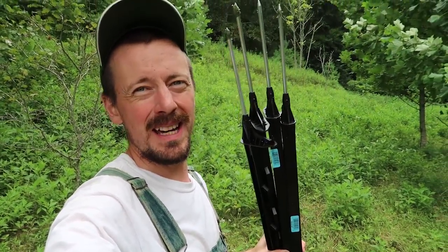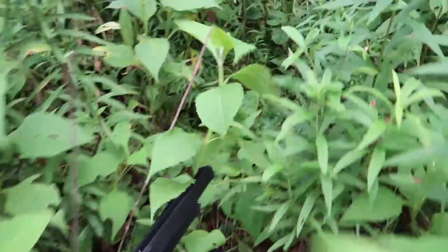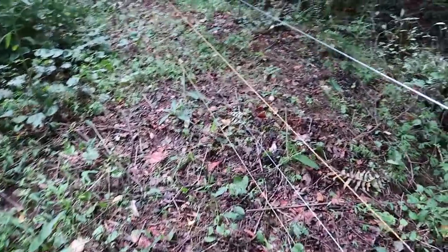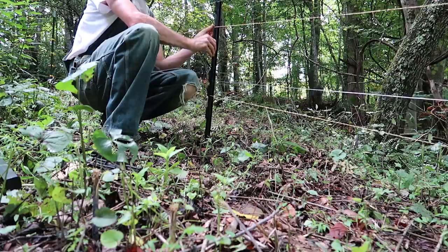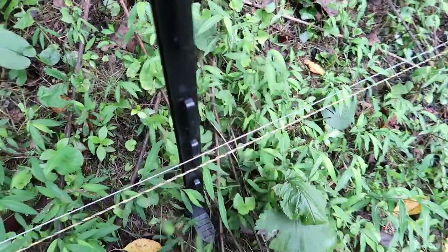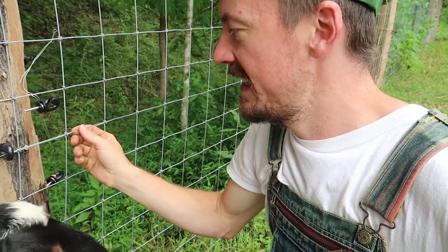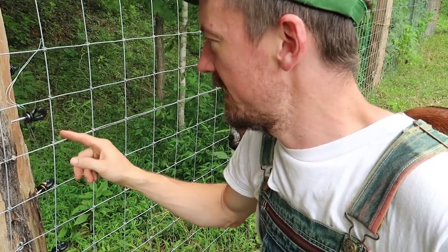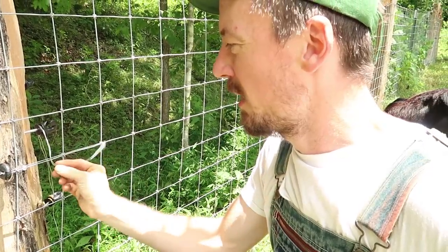I'm here in the back pasture. I just have four of these temporary step-in posts. I've got four spots I need to put them to make sure the fence isn't grounding out in the grass. Here's a spot that could use a lift — that bottom wire is just too close to the ground. Another spot could use a little spacing and a little bit of a lift. I've got all four posts in and now I'm just walking the fence line, checking to make sure nowhere is too high from the ground. Let's connect this fence to electricity and get the animals out there. This is the hot wire coming up from the electric fence, and this is the tail end I left on my fence system around this pasture, so I'm just going to wind that around this wire that will shortly be hot.